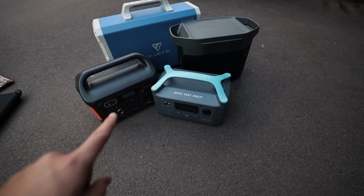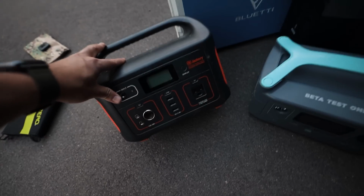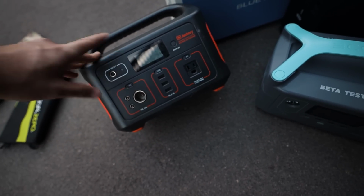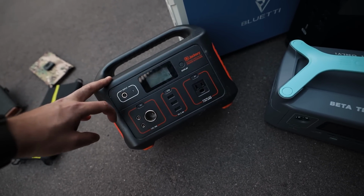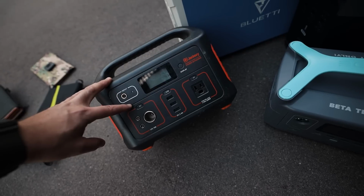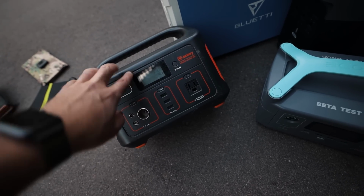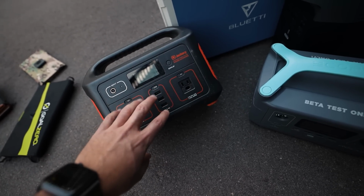What you can do from a 12 volt battery is some common DC things you are familiar with, like USB and the cigarette lighter from your car. There are plenty of other DC plugs out there, but those are the common ones. So we're getting sun energy, DC, into charging a DC battery, and then using the DC ports. That's the most efficient. There's not a whole lot of loss.